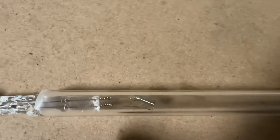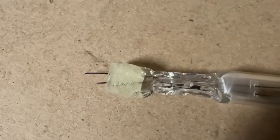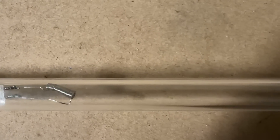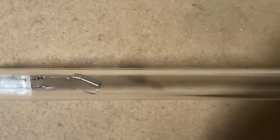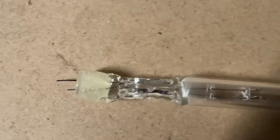What I'm going to do first is heat this entire tube up to remove any traces of water from the glass, let it cool down, connect it to a two-stage vacuum pump, evacuate it to as low a pressure as I can possibly get, then warm-seal it. Then I'm going to put an electrical current across that titanium and heat it to bright yellow heat to try and burn out any traces of nitrogen or oxygen that remain in the tube, hoping to get all the air molecules out so we can use it as a cold cathode x-ray tube.